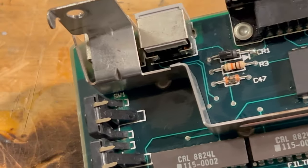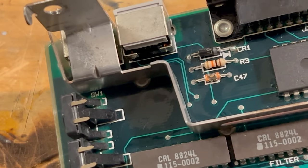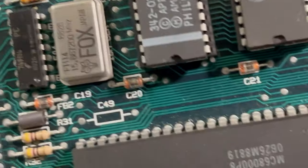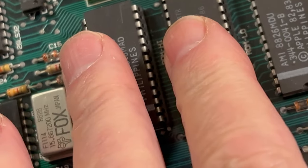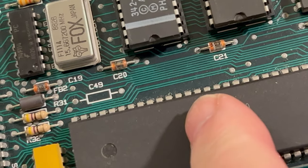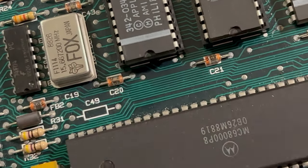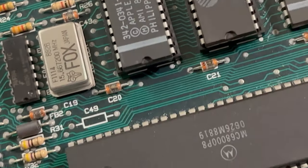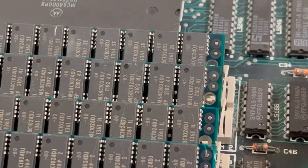So next video, we're going to be building the Raminator. We'll be able to boot off the ROM on this thing. The existing ROM chips come out, the Raminator board goes in there, and then the new program ROM goes on top of that. We also have to run three wires — that's how we're going to get the power to it. Three wires soldered on the legs of the chip. It's a very, very low-profile setup — a little revised version. It'll slide right in and out without hanging up on anything. Then we will boot it up and see how it works.